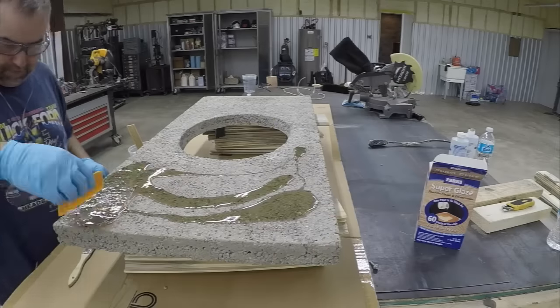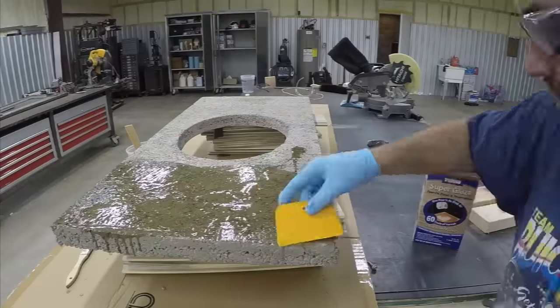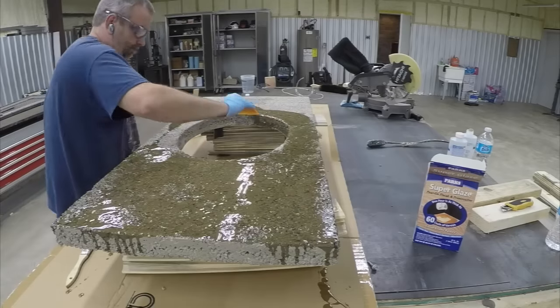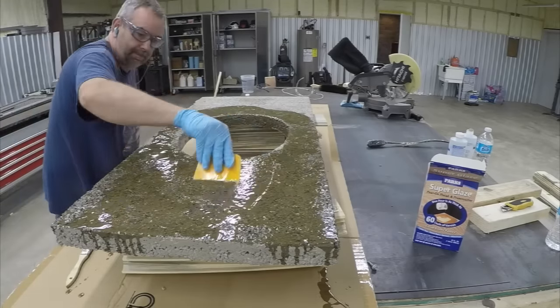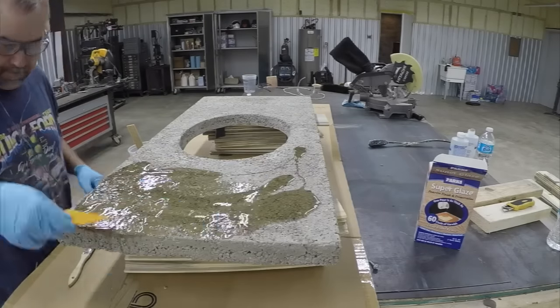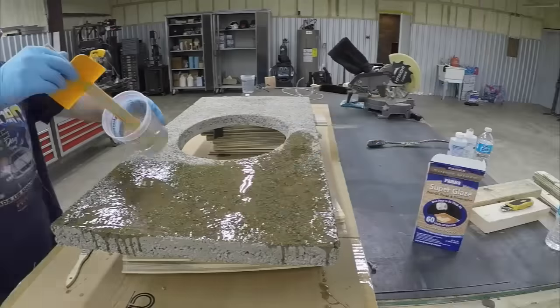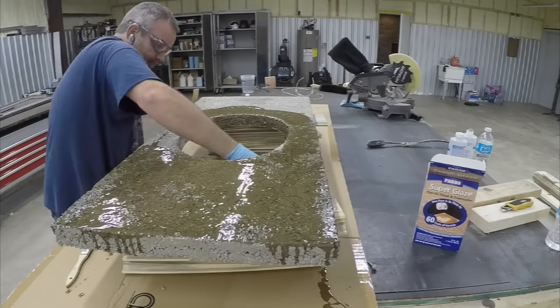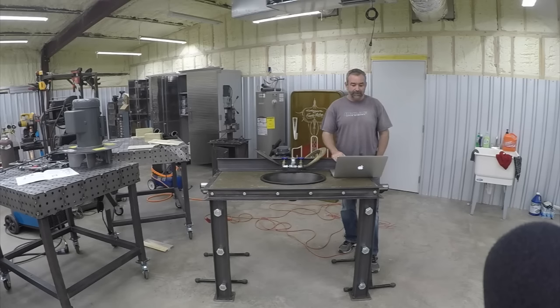So here you can see I used some bar top epoxy — it's really meant for wood, but epoxy will stick to most anything. Because of the rough surface, I thought for sure it would stick to that, and it seems to have. But that stuff comes off really glossy and shiny, which is not really what I was going for. So I block sanded it smooth — I don't have video footage of that — and then I coated it with the urethane concrete coating that we used on the garage floor. I had some left, so I just mixed some of that up and got the matte finish that you see. So really, the question is: is this a really excellent failed recovery, or is this just a cover-up for sloppy hack job work? What do you think? Leave a comment, let me know.